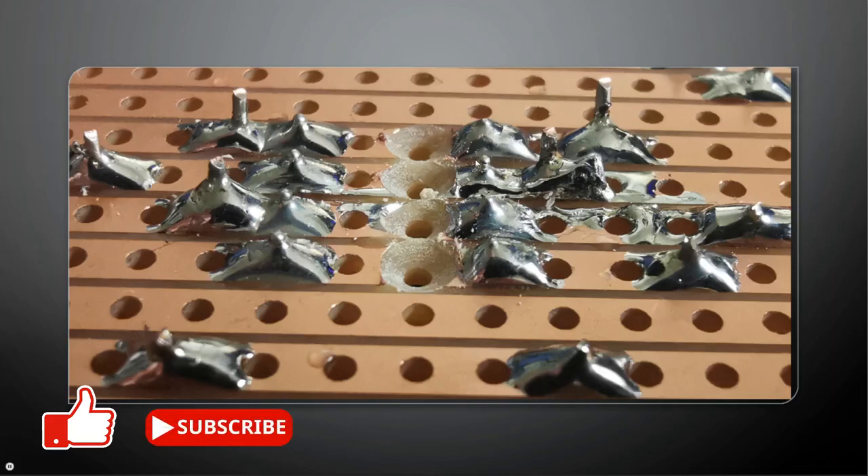Here's an example of a board with an eight-pin chip. Each of the tracks had to be cut using a three-millimeter drill bit to cut away enough copper to stop the connection. You don't want to drill too far or you'll end up going down through your board. By the way, these can be drilled by hand — you don't need a power drill. Just use a drill bit in your hand and gently scrape away at the copper.